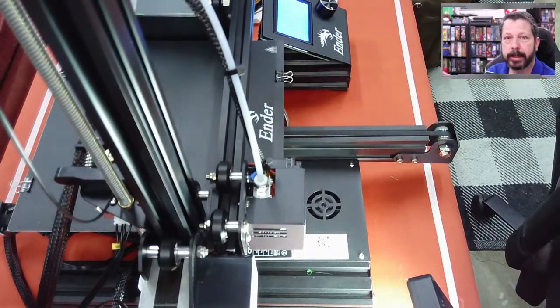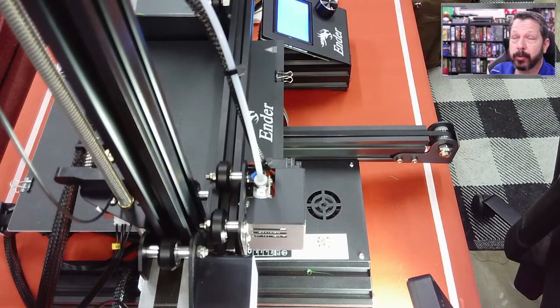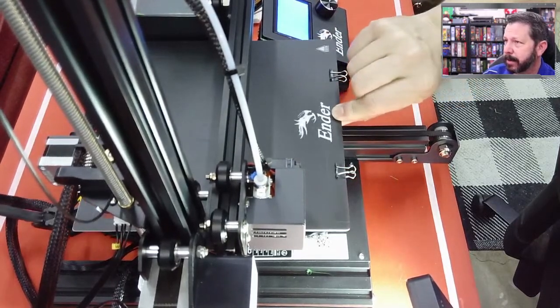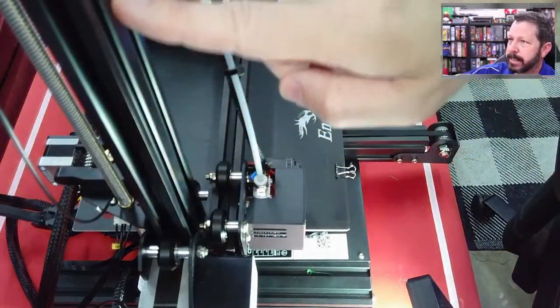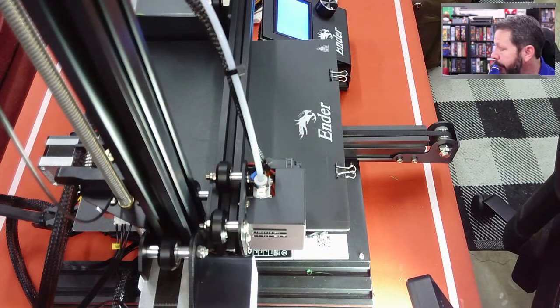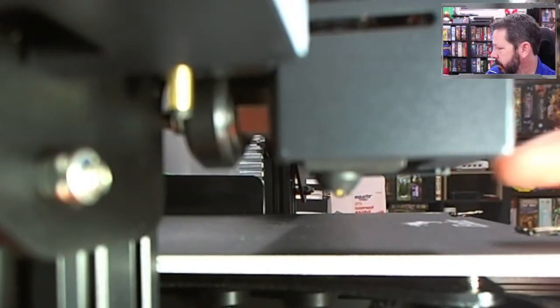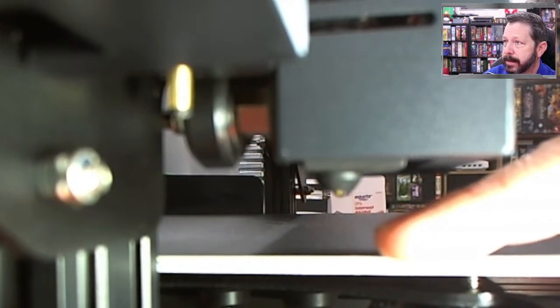It's not level like with a bubble level that you would use to check if a staircase is level or something like that. But maybe a better word would be trammed. That would be more on the CNC, like a mill type of approach. Those words would be more like what we're doing here. But we say level, and what we mean is that this bed moves in a plane that is parallel to our other axis here and perpendicular to our z-axis. So parallel to our x and perpendicular to our z, so that everything is level, meaning that the nozzle, I actually have a close-up of the nozzle. Where'd it go? There we go. So there's our little nozzle. It's kind of out of focus, but maybe I can force it to focus on it. I don't know. But there's a little nozzle. That the nozzle is a consistent height from the bed.